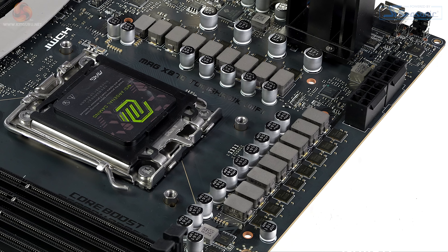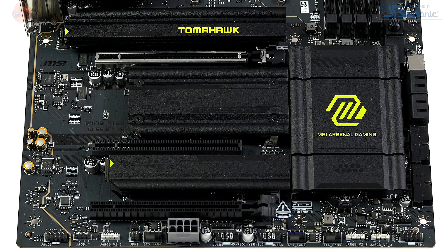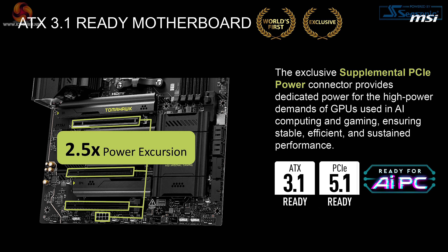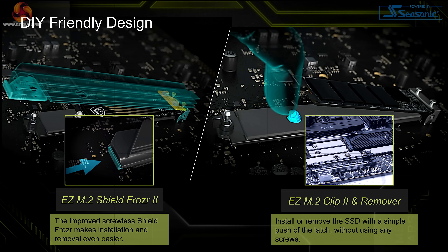What other features do we have? The PCB is 8-layer. The VRMs are 14 by 80 amps. We've got USB 4, which is ubiquitous on X870 and X870E. There's support for PCI Express Gen 5, and there's also supplemental PCI Express power. There's an emphasis on cooling both at the VRMs and on the M.2s, with M.2 Shield Frozr heatsinks. The motherboard supports ATX 3.1, so it's ready for the latest and next-gen graphics cards.